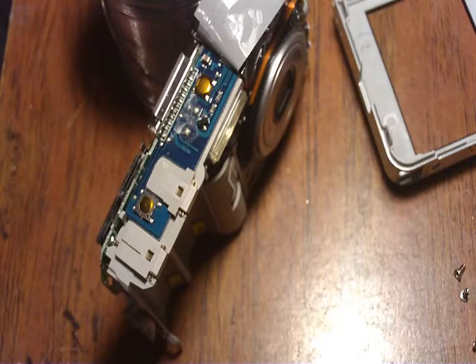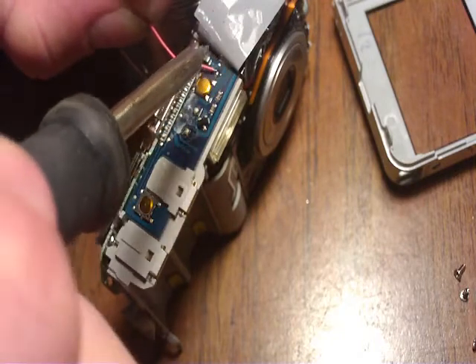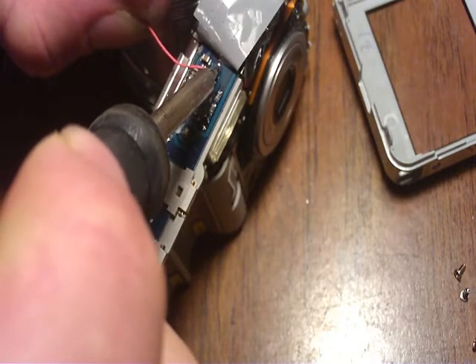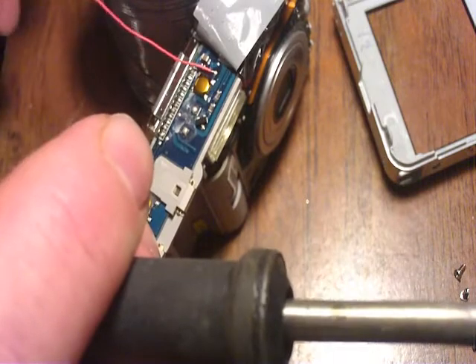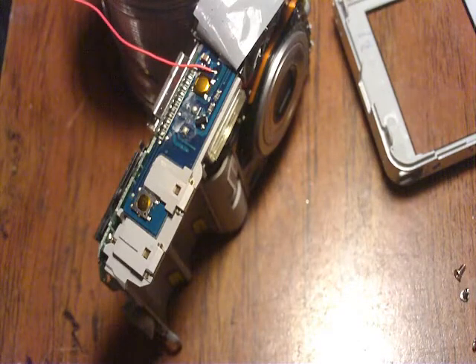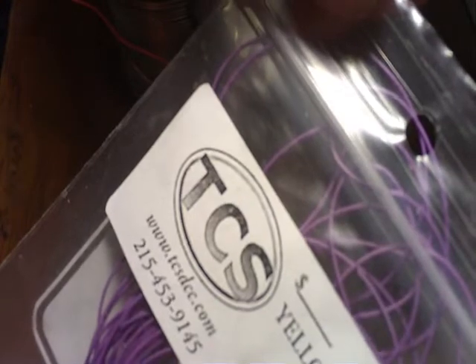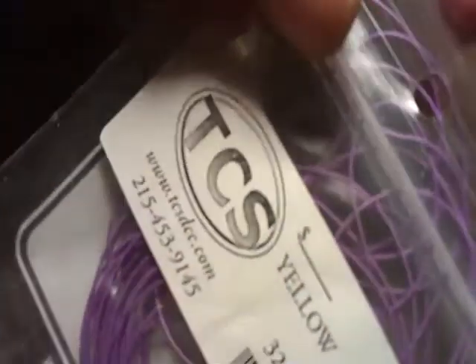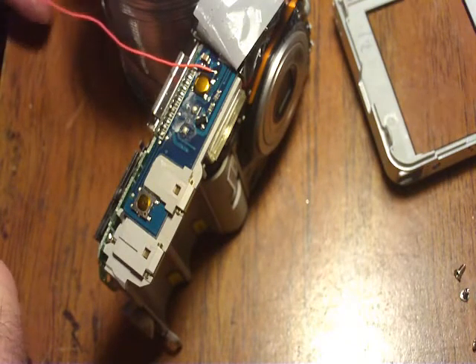I tin my wire and then all I've got to do is solder that wire right there. I'm using 32-gauge wire, and I'm getting it from TCS — it's www.tcsdcc.com. You can get 20-foot of it. It's a really nice wire for doing tough hacks like this because the contact is small right there. So that's my power wire.